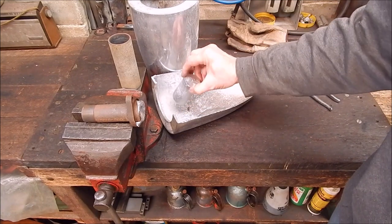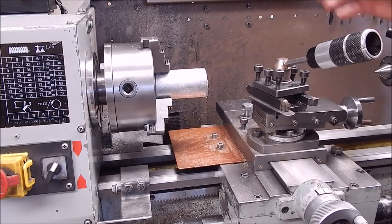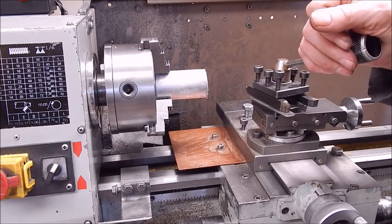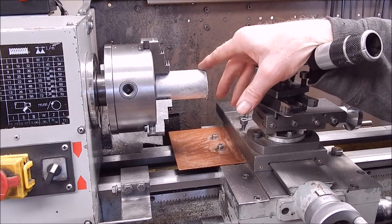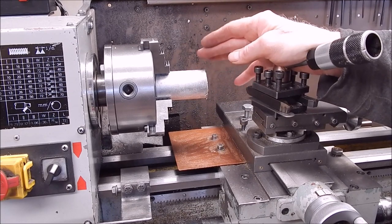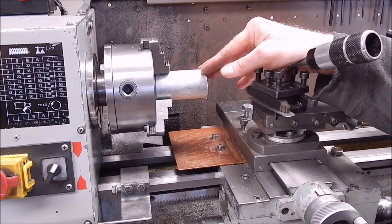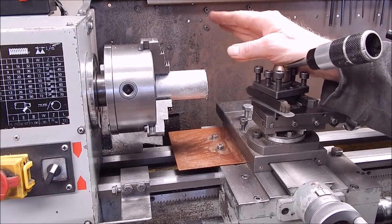Okay, let's put this in the CQ9325 and spin it up and see how it comes out. I've stuck it in the three-jaw, and I'm going to run a round-nosed high-speed steel cutter over it — that's a good test. I don't like using carbide on aluminium unless you buy the proper aluminium cutting carbide bits. General purpose ones — don't do it. Use high-speed steel, you'll get a better finish. Put a bit of lube on it — WD-40, kerosene, or a kerosene-engine-oil mix like I use. So we're good to go.